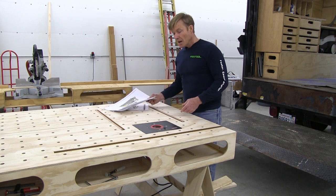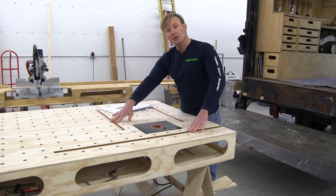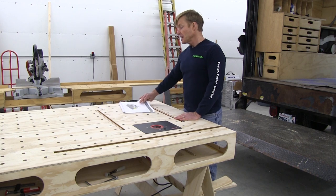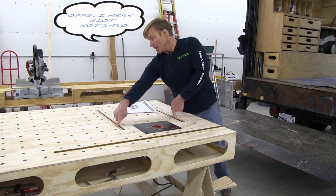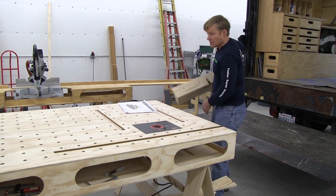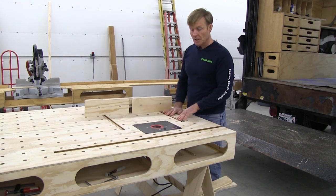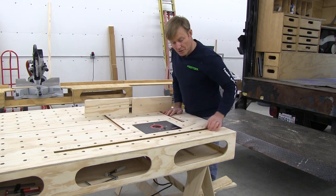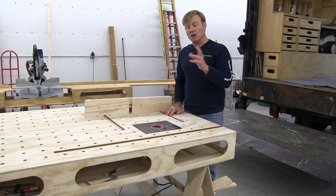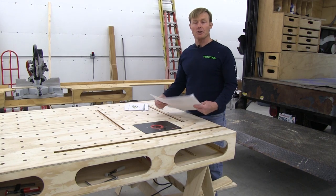Most of the changes are subtle and have to do with layout, but the big one you'll notice is I've eliminated the two T-tracks and the miter track. These are metal Incra or aluminum Incra tracks — they cost about $50 for the three and they don't add anything to the workbench. Instead I put a 3/8" dado right where these are with a one-inch hole on either side, so the router fence just needs a washer added and drops right into those holes — doing exactly what the T-tracks do. For the miter track, I replaced it with a standard 3/4" dado, which is the standard for table saws and router tables. Those are the changes the plans reflect that you don't see on this workbench.